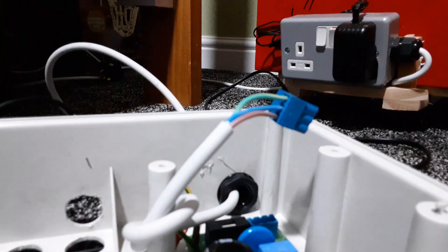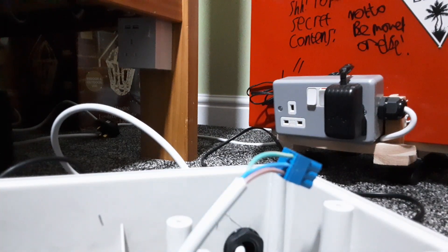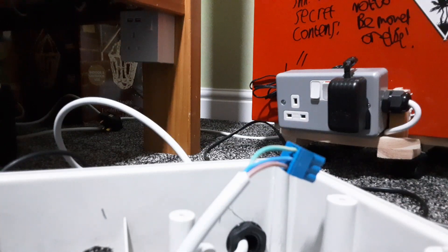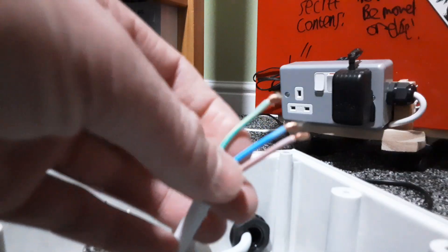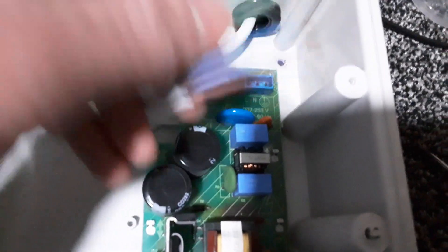On these CTEC CFPs you can take the power block out if it's a blue one — you just unscrew these and take the block away. You can see how the wires are lots of little tiny parts; that's what makes it flexible. You also want to make sure you have a cable strain relief so that if you pull the cable it doesn't pull the wires out, as that can also cause a problem.